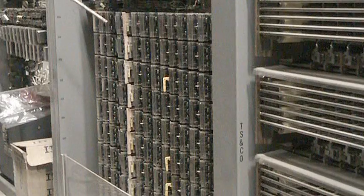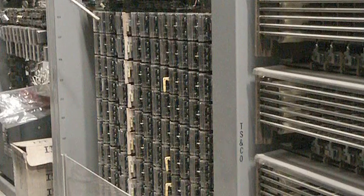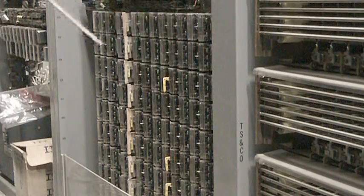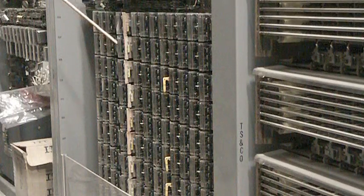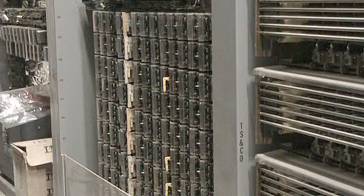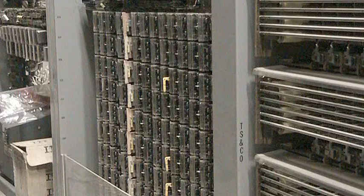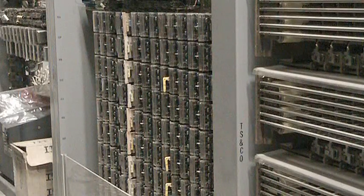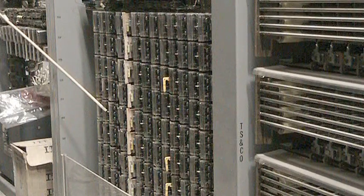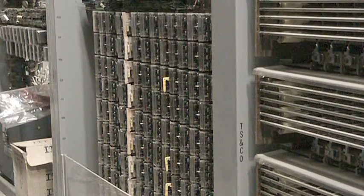These are the IAOs. These are effectively an intercom, of course, for the number 3 crossbar. So the originating customer would be on one side of the trunk and the terminating customer would be on the other side. These were only used during an intra-system call. Calls outside of the system would be on a trunk. Incoming calls to the system were on a trunk. So there's a limited number of IAOs. Because it's a 400 line office, they didn't anticipate that many telephone calls. I have, I believe, 30 of them, which of course means you would have 30 local calls at any one given time.